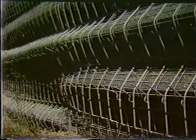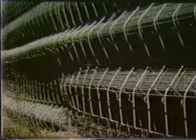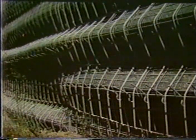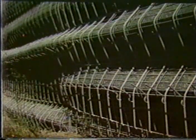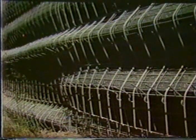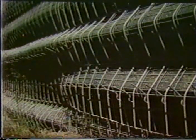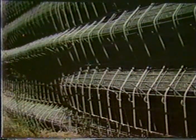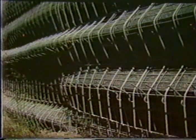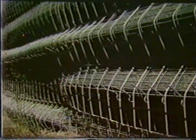This is another close-up of what happens if you try to put cohesive soil behind the front face. You add load to it, and if you haven't compacted it, then the layers compact and get a lot of distress. This was so much so that some of the connections were starting to fail. So this is excessive. Compaction at the front face is important, and it's most easily obtained by placing pea gravel in the front face. And then this is what it looks like when it's properly done.